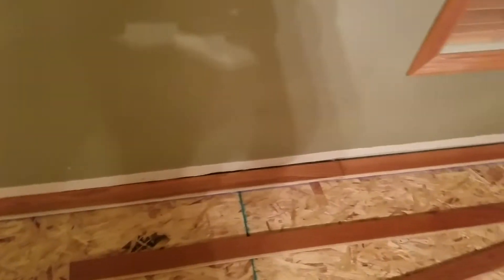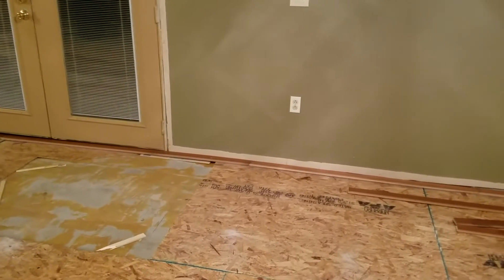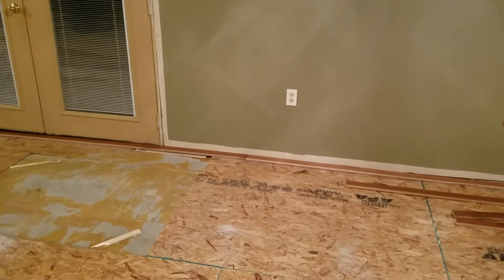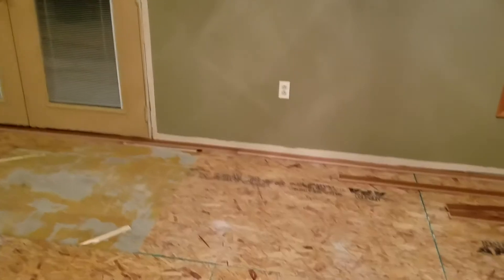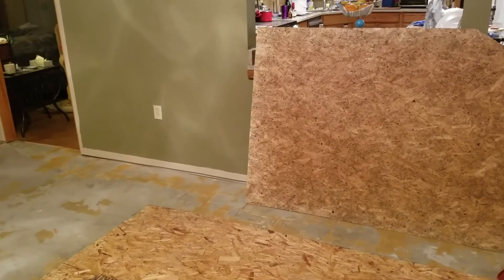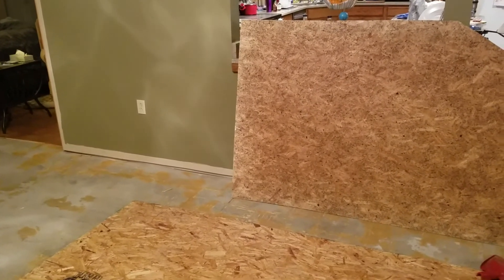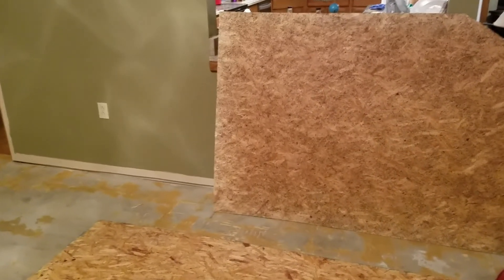The first row is top nailed, which you can't see. If you haven't laid floor before, you basically pop a line from your base plate under your sheetrock to whatever length your flooring is, add a quarter inch or half inch, and then you'll measure across to the wall on the other side. It should be even — if it's not, you adjust your line so that it equals with your cross wall.